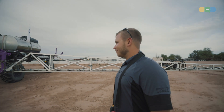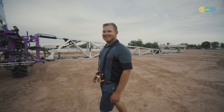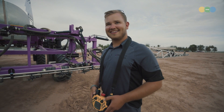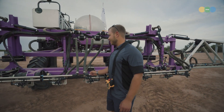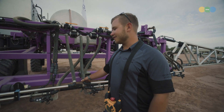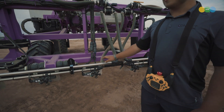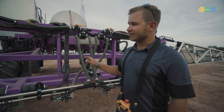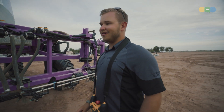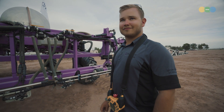Is there anything else you're proud of? One thing we're working on is developing a recirculating boom. A lot of standard sprayers only have one boom pipe, so they wouldn't have this top line. What we're doing is adding another line that allows product to continuously recirculate back to the tank, allowing for a more even charge pressure in the lines.